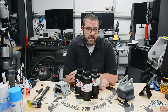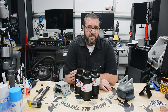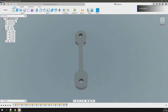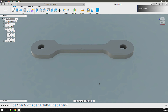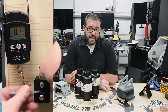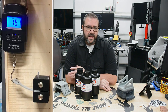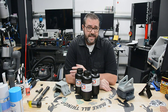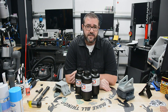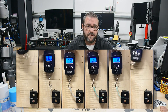This should give us a general understanding of how they behave and what to expect at scale. For the test, we'll be performing three break tests of each of the mixtures to see how they perform. The dog bone shape was designed quickly in Fusion 360 as a simple 3mm extrude that's 5mm wide with mount holes on each end. I'll be fixing one side of the sample to a fixed plate and pulling up on the alternate side using an inexpensive scale to capture the pulling force, stressing the part to failure, and capturing the force required that caused the part to fail.